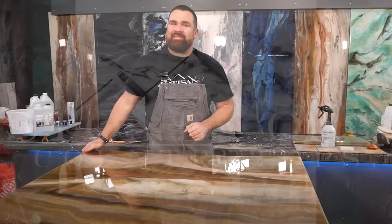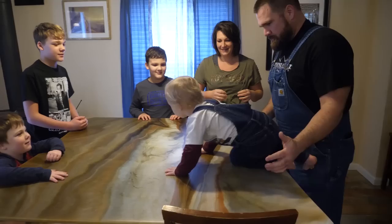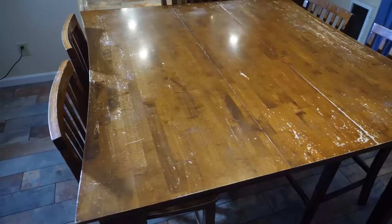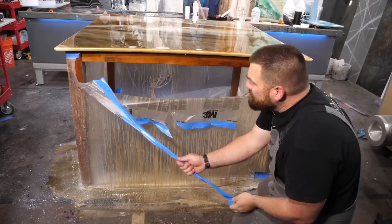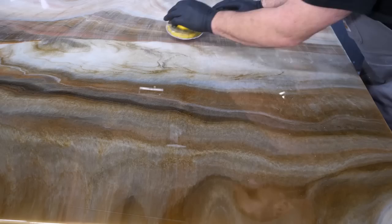We're back — it's the next day and my flood coat is dry. This table is pretty much ready for install, but I'm going to take it up another notch. I'm going to install the Ultimate Top Coat because I have four young sons — and you all know how this table looked before I applied the Stone Coat. Before prepping for the Ultimate Top Coat, I'm going to remove the plastic that protected my legs while I poured the epoxy. After removing the plastic, lightly sand the surface and edges with 220 grit sandpaper for a mechanical bond of the top coat.